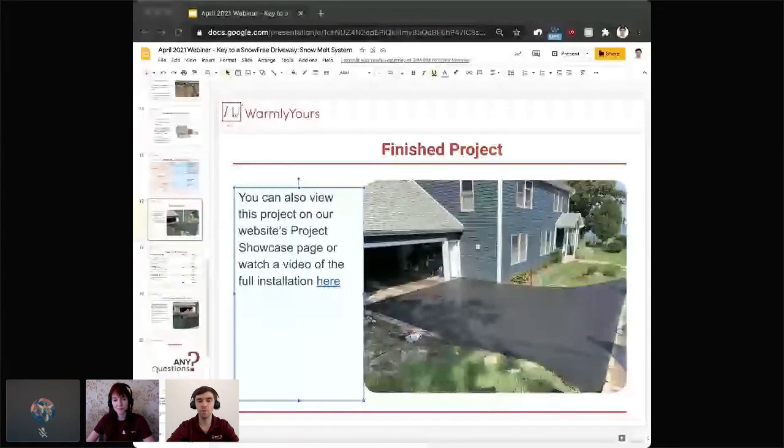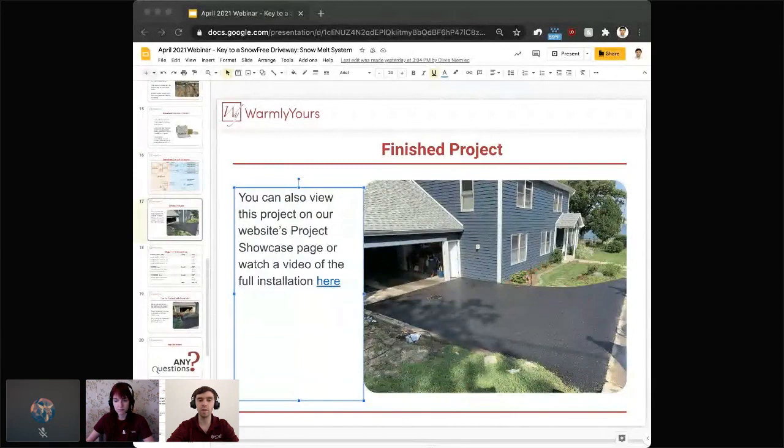Let's just say if there are some cracks, but we don't know where that damage is or where the wire was compromised. We do have the tools, like a troubleshooting kit with a thermal camera, that can be used to visually detect where that hot spot is and then get only the right spot opened and the wire repaired. We have the videos and the instructions that show how to do that, and eventually get this all fixed and get the system up and running again.